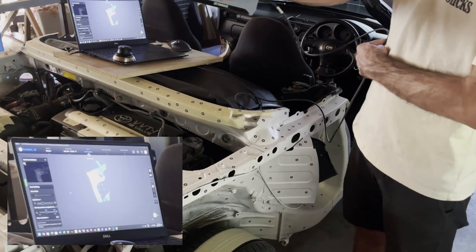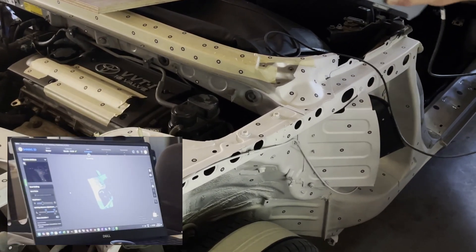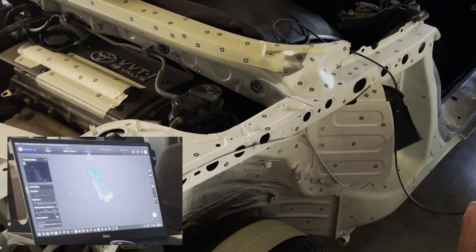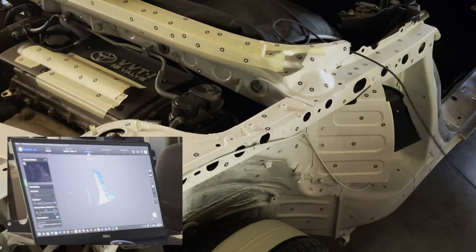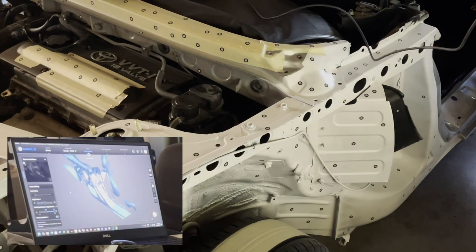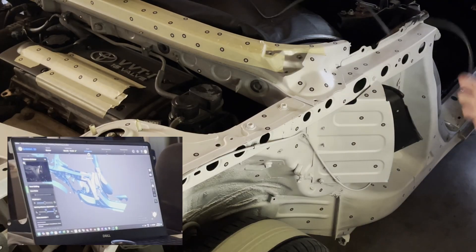Here's what it looks like once I've done all the prep. Marker dots are on and I'm actually able to start the 3D scanning. On the left is what the 3D scanner is building out in the rear section that I'm scanning. The white is what the camera is currently seeing, and the blue is the data that's been captured. I generally go over one area at least twice to make sure there are no errors.